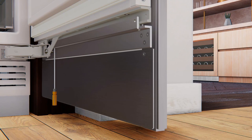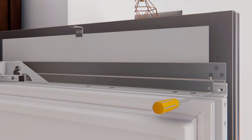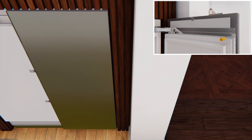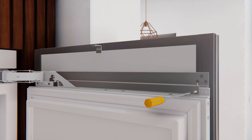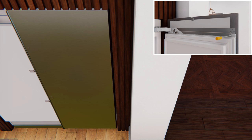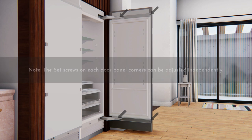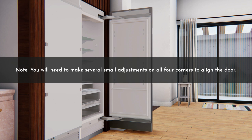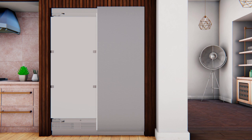Move to the bottom corner and install the set screws — do not tighten them yet. Install and adjust the four outermost horizontal set screws at the corners. If the stainless door panel is too deep inside the surrounding cabinetry, turn the set screws clockwise to move the door outwards until the panel is in position. Install and adjust the four innermost horizontal set screws at the corners. If the stainless door panel is too far outside the surrounding cabinetry, turn the set screws clockwise to move the door inwards. Note that set screws on each corner can be adjusted independently — make several small adjustments on all four corners to align the door. Once in the desired position, firmly tighten all remaining set screws to secure the stainless door panel.